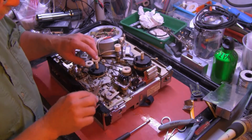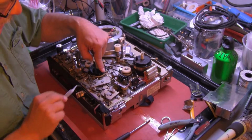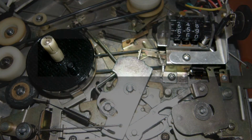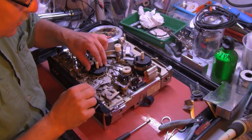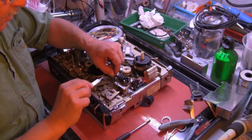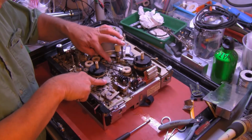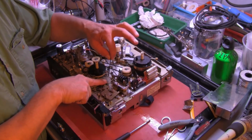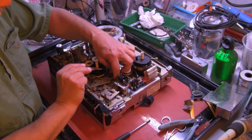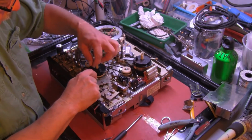Now this one is difficult to thread through. It originates at the take-up reel and goes across under this upper mechanism. So you have to unthread it that same way. So from under the tape counter over the bracket that we loosened. Now there's a lever that runs from here over to here, and the counter belt goes under it. So pull it out from under that bar, just like this, so that it's clear, and then it will come off of the take-up puck.